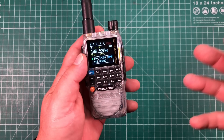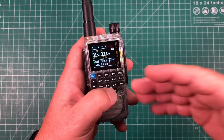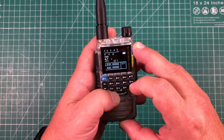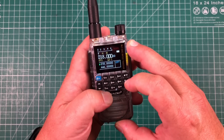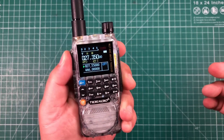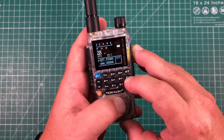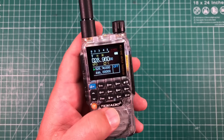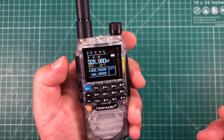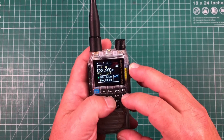This radio also has an incredibly wide receive range — all the way down to 18 megahertz. It's FM only, so I'm not sure how useful it'll be, but CB just allowed FM so you could listen to CB FM traffic around 27 MHz. Same thing with 10 meters — tune to something like 28.960, which I think is the FM calling frequency. If 10-meter FM is open, technician licensees can listen even though they can't transmit. You'll need a different antenna, but it does the thing.